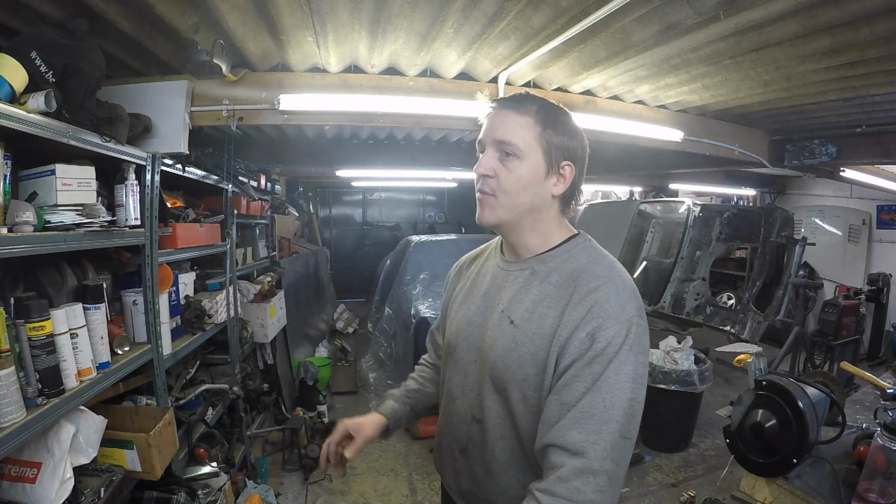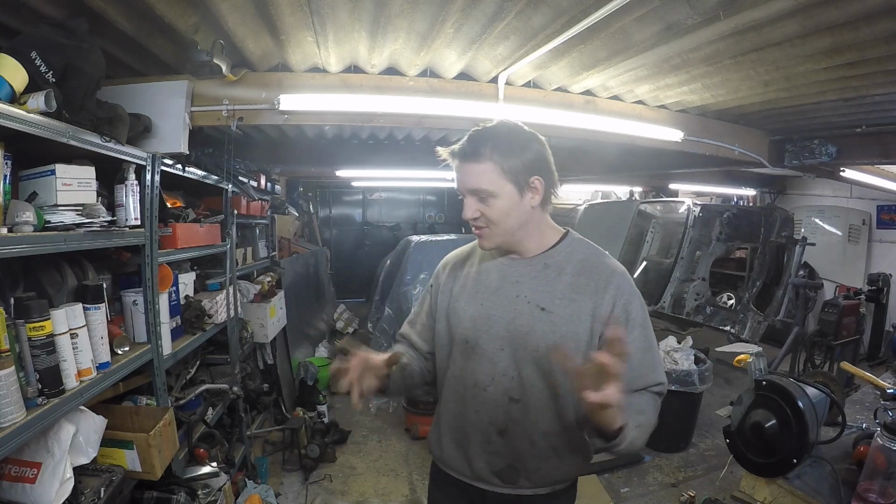The pedal boxes are in the car. I wanted to check that all the pedals align well before I paint them. If I've got a nice accelerator and clutch and then the brakes at 10 degrees and the foot pad isn't aligned properly with my leg, then that'll just drive me insane for the rest of the time. I need to do that, but I need to ream those bushes on the pedal quick, and then I think I really need to put the seat in if I want to be exactly sure where the pedals are and happy. I need to align them with the photo as well, but just to kind of bring everything together, I think that's going to be a relatively long task.